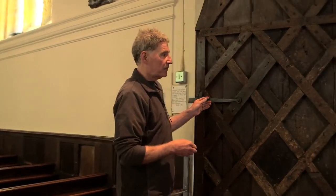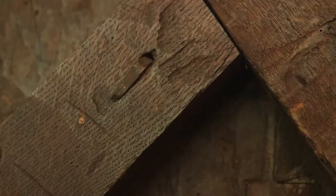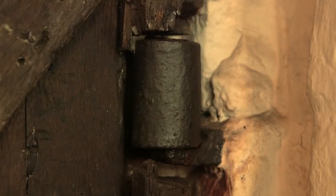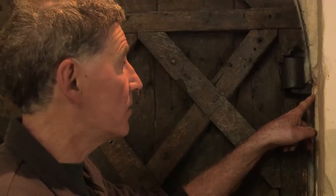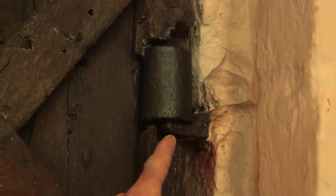From the metalworking point of view, the inside of the door is all held together with nails — very ancient nails. They're what's called clenched nails, because they've been driven through to hold the ironwork and hinges, and then bent over. You need a pretty decent iron to do that, because a lot of old iron was very brittle and you couldn't use brittle iron if you were going to clench them. The actual hinge pintle here, which must be very ancient because it's built into the fabric of the church, is incredibly worn — it's lost about three quarters of an inch over the centuries. The hinge itself isn't as worn, so that makes you think: what happens in another 500 years when the hinge wears through altogether?